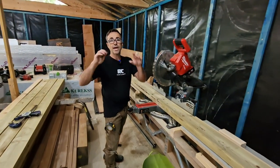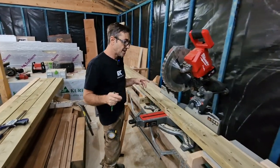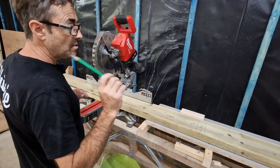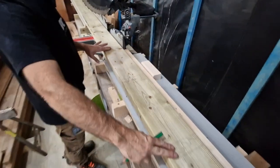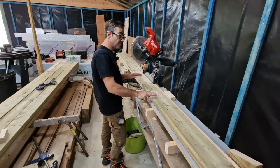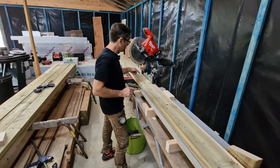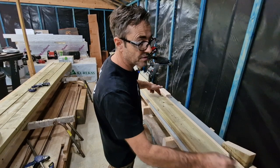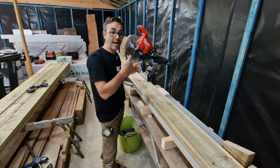But in the middle of the wall, we have a special dehumidifier and air heater which goes through. So we've had to allow for that as well. So we found the center of the room and we set our studs accordingly. And so we know this is the center of the room in our case. This stud and this stud are slightly off the 400 centers, but then we've kept all the rest to the 400s from the center either way. So when we put our boarding on, it's only just slightly out. So if we put a board from there to this one, perfect. Or from this one to that one, it's perfect again. So that just means that you can move the stud slightly and you can still get your boards to work, providing you lap the moved stud.